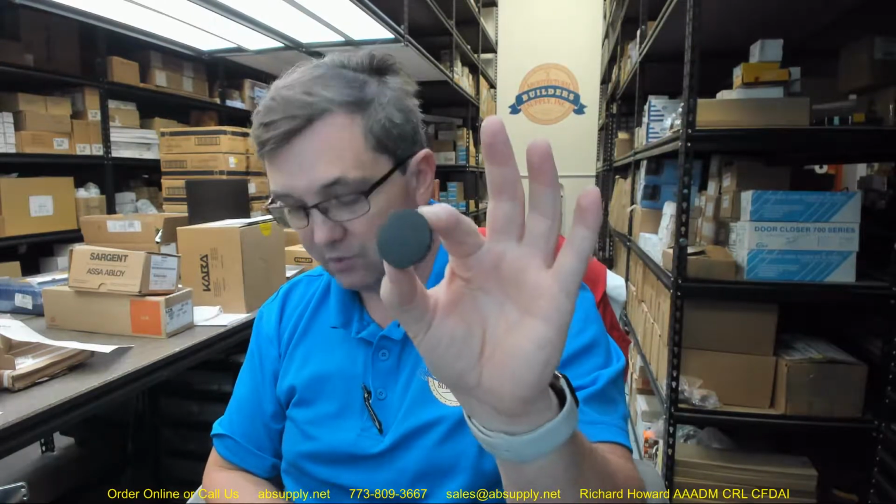This cap literally is what you see in door contact switches. GE makes them, other people make them, and then you'll have a magnet that will be capped inside of there. So this piece of plastic is typical. This goes on the active door. Your fire door bolt goes on the inactive door, the way that it's been listed. It's also listed that way in the installation instructions.